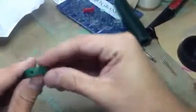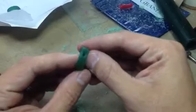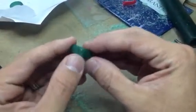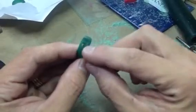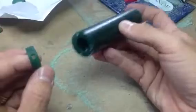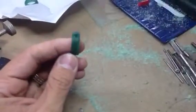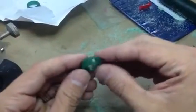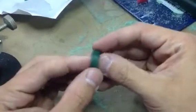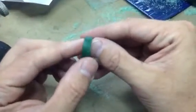I just carved this wax ring. This is going to be a men's wedding band that I'm going to cast in gold. There's going to be a half-carat diamond set in there, so I took my setting burr. We started with this wax tube, the standard wax tube, cut the width of that. Then started taking some files and other wax tools and carving it down until we had something nice and symmetrical. Then we did this really organic finish on it with a file.